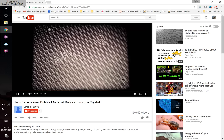The other dislocations are moving around happily, but those dislocations want to be right by it because a smaller atom will make the other atoms around it be under tension, right? So the compressive part of the dislocation wants to hang out in that vicinity because overall, if they're separate, it raises the system's energy, but with them together, it reduces it.